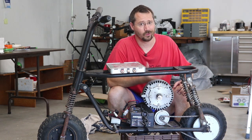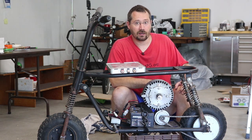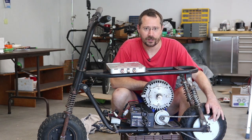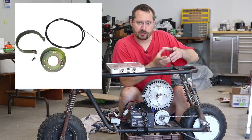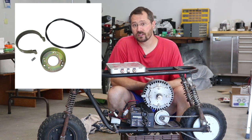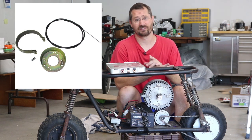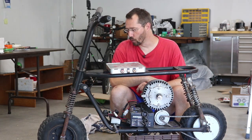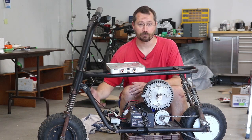Typically your chain has some grease on it and you don't want grease on something you're braking on — sounds a little complicated. So I did manage to locate a band brake. I can mount a narrow drum back here. A band brake is almost like a drum brake but inside out — it uses a drum, but the braking happens on the outside of it instead of the inside. I've never used these before, and it seems like it's probably not going to be fantastic braking. But up here on the front wheel, I've also got that same bolt pattern going through the rim, so that's another possibility — I may be able to add front brakes.